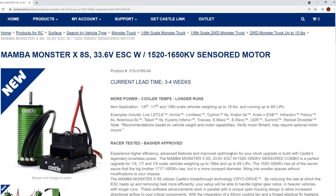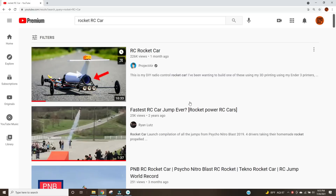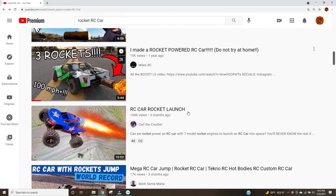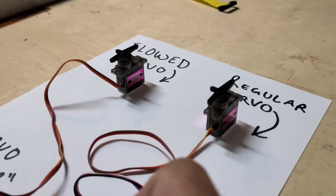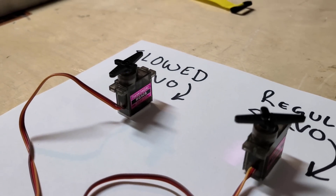I want to thank a lot of y'all for some really awesome feedback on the fan car system — you pretty much confirmed I have to go with a different approach if I want to improve the stuttering at the beginning. I also know I could have used model rocket motors to save a lot of weight, but that's not a cold gas thruster, so it's not in the same category as the Tesla Roadster SpaceX version. The servo delay module was also inconsistent — even with the same setting, the delay was all over the place during 1.1 to 1.5 second launches. Thanks everyone for watching, if you have any questions or comments please let me know. Love hearing from y'all — as always, thanks again and y'all have a good one.